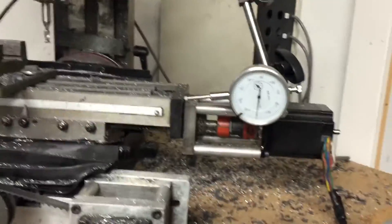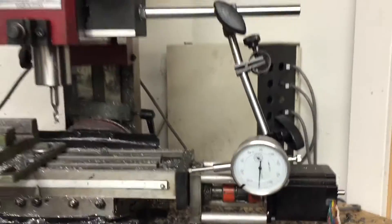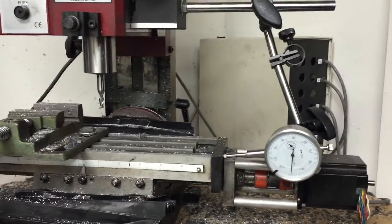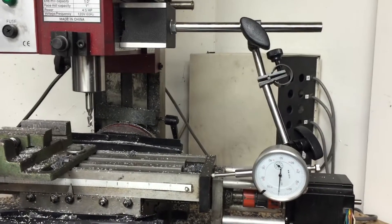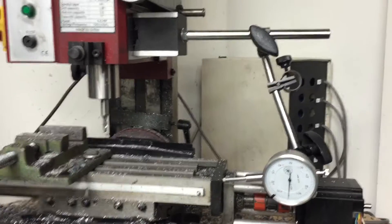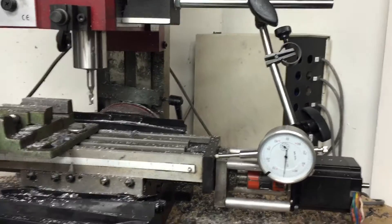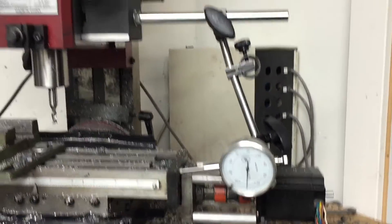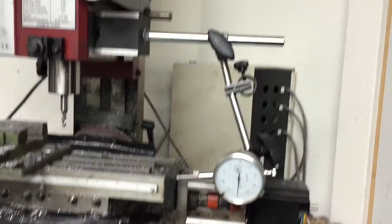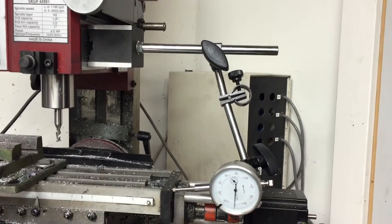Check this out. I'm doing a little test here, testing the backlash on my machine. I noticed that when I was doing a hole there was kind of a flat spot on the Y part. I knew it must have something to do with my backlash settings. So I checked and they were set for five thousandths of an inch. But I tested with my indicator and was actually measuring twenty thousandths of an inch backlash. I adjusted that and my circles were good.